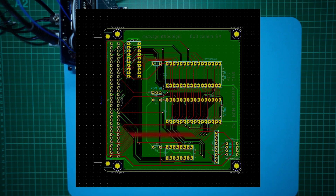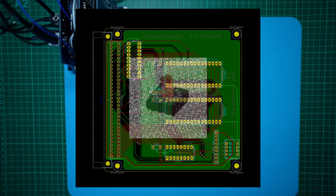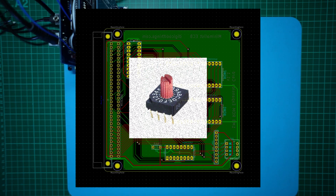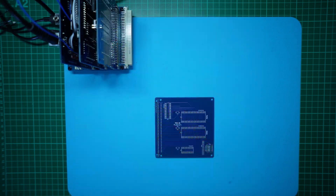You can of course just use a 4-way dual inline switch. But the DIP8 footprint also accommodates a rotary coded switch, which allows a very easy 1-of-16 bank selection without needing to toggle 4 binary switches. I've used rotary coded switches for other projects and quite like them.